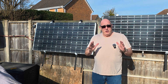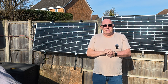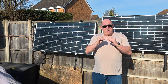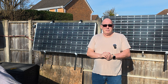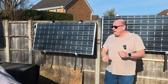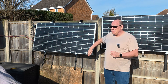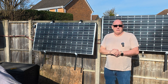So how does the tracker work? It's really quite simple. Up in the top corner you can see that little silver disc. That senses the amount of sunlight and can track whether the sunlight is moving up or down in relation to the sensor. Based on that information it can calculate whether the sunlight is increasing or decreasing, and then send instructions to a motor on the back which can lift or lower the panel to make sure the sunlight is coming down to the panel at the optimum angle.